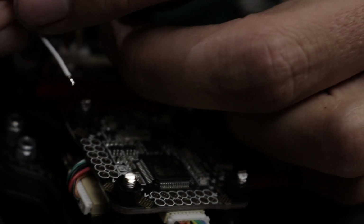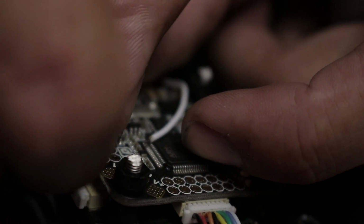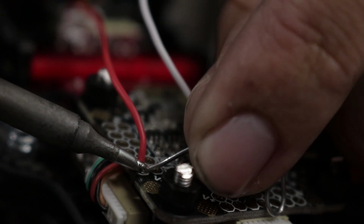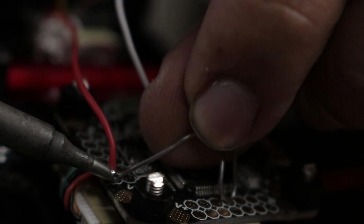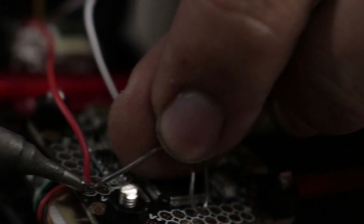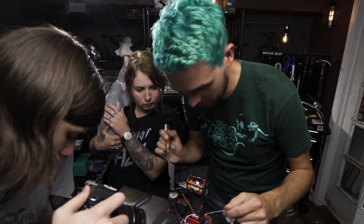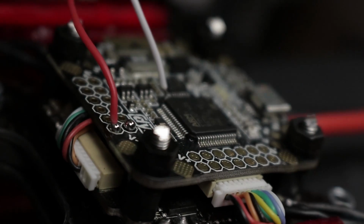So with the wire tinned and the pad untinned, you can just kind of insert the wire into the hole. So we got the wire just inserted in the hole with no solder, and now we're just going to apply solder to that. That's kind of my favorite way to do it the first time you're doing a build. But let's say your pad already has solder on it because maybe you're doing a repair or something. So for this ground over here, I'm going to go ahead and pre-tin it. So now I've already got solder.